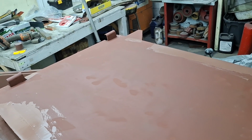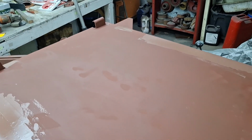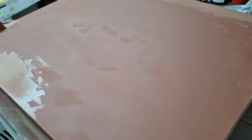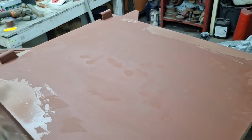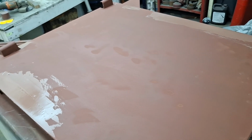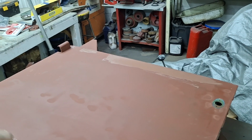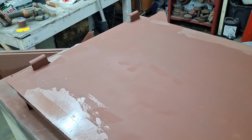220 grit sand, good. And then layer primer on it. By spray canning primer, I can see the highs and the lows. Mark that out with a crayon I have. If it's a high spot, sand it real quick. That's about it there. But these spots I have done here, again, in thick primer and spread it on.